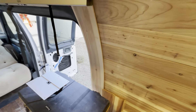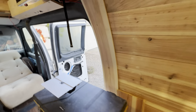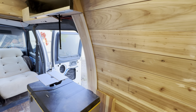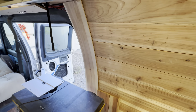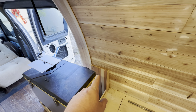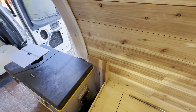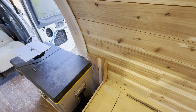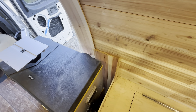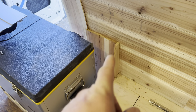This is a piece of cedar and I actually planed that down to a quarter inch thick — you guys can see how thin that is right there. That allowed me to bend it and fit it in place without it splintering, but it took a little trial and error to figure it out. Down here there was a little gap where the boards didn't go all the way across, and I just had to fit those in place too. I know it probably doesn't seem challenging, but it was very, very hard to get everything to line up and sit just right.